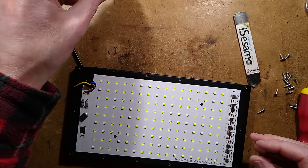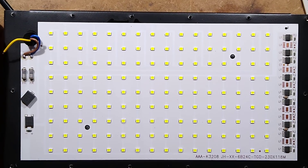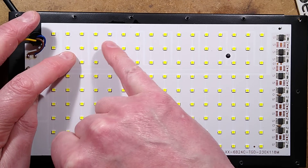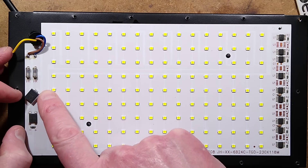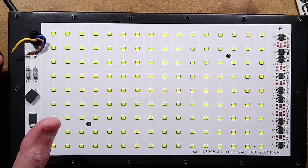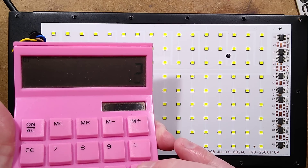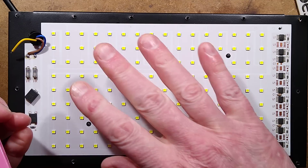The configuration of the LEDs: what I can see here is that we've got the top row — it looks as though we've got six in parallel, so these must be multi-chip LEDs. Counting through all of them, there are twenty-four groups. If that is three chips each, twenty-four times three chips — seventy-two times three volts per chip equals 216 volts, which is what these normally aim at, because it is basically unrectified — they're going with this sort of RMS voltage.